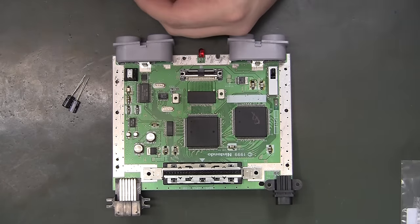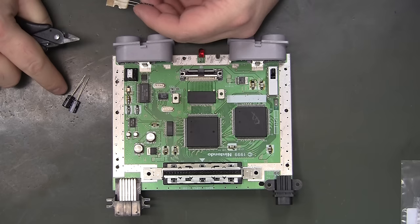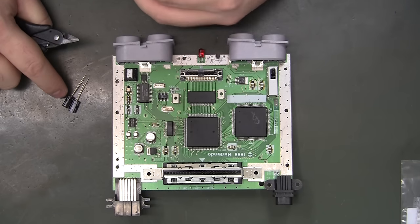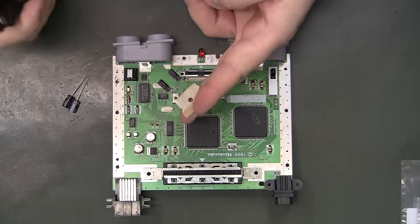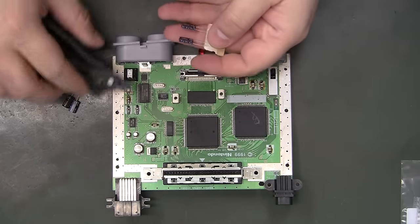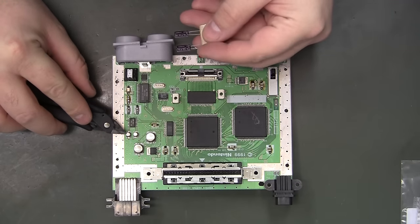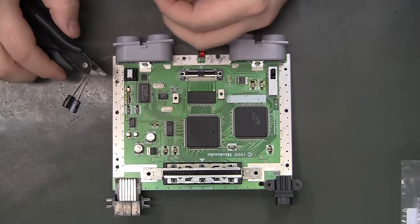So for the analog outputs, I caught a break on the 220s. The AV Famicom has a 220/10, so I've got a bunch of those for the high-def NES cap kits. And there's also a 10 microfarad, but it's 50 volt. Just means it's going to be larger than I need in voltage, but that usually means that it's physically larger too.